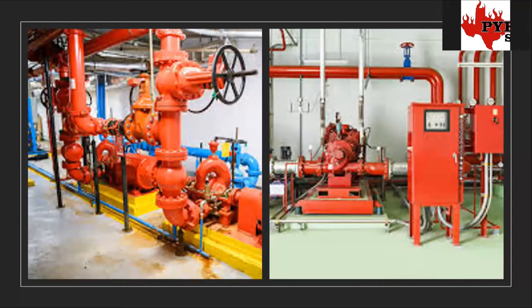So that's the overview of what's going on with sprinkler systems: there are valves and water flows. If there's any kind of switch on a fire sprinkler system, we have to tie into it — we don't really have an option. Every individual valve and every individual water flow all get their own individual monitor module so they can all report in with their own specific address and description at the panel. By code we're actually allowed to put more than one on a system, but for service purposes we stick with our standard of one monitor to one switch.